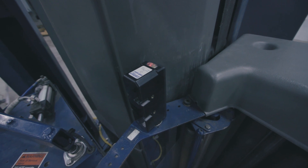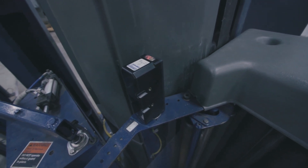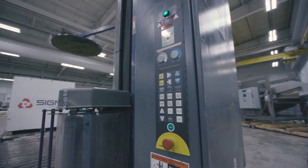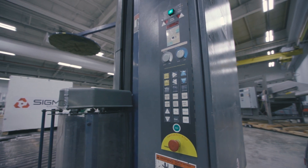This wrapper comes equipped with a photo eye sensor that can detect the top of the skid, which determines the travel height of the carriage. The control panel offers many adjustments for the machine including wrapping speed, turntable speed, and start and stop features.